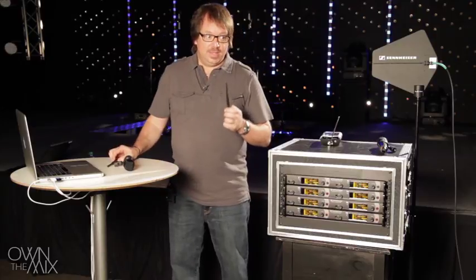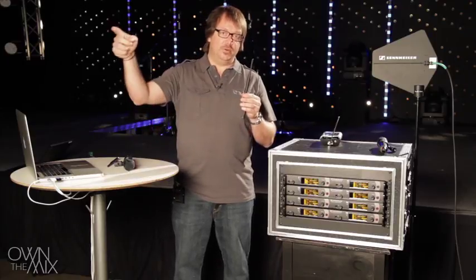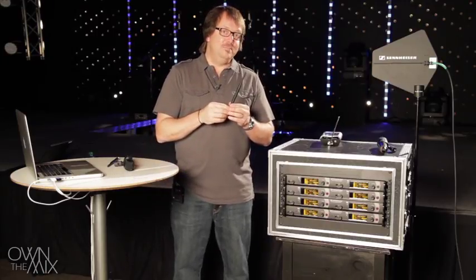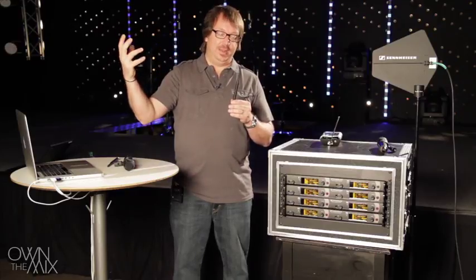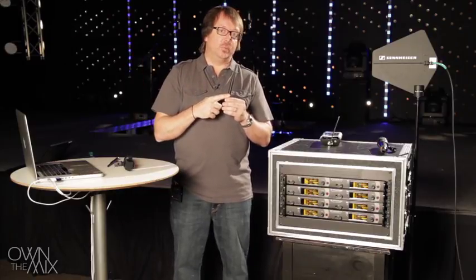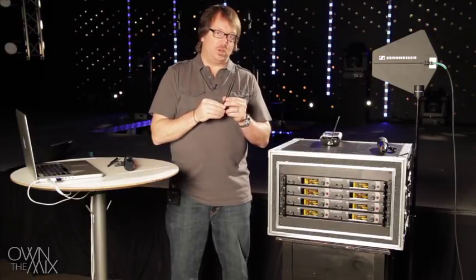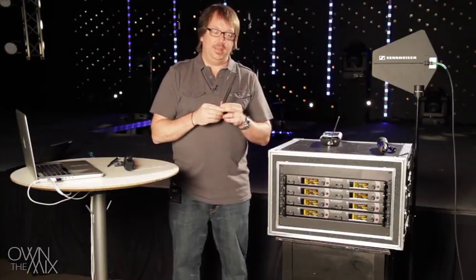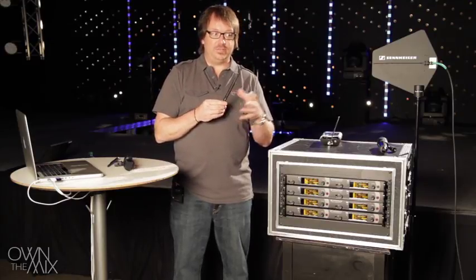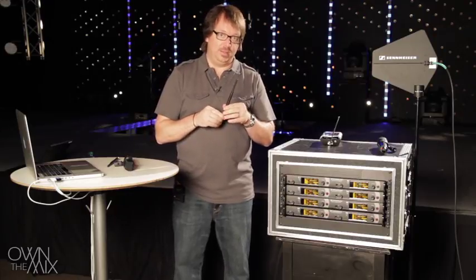If you imagine we put one antenna in space to receive in your church, the transmitter is moving about the stage — a person wearing a body pack or maybe holding a handheld wireless transmitter. As they move around, the RF leaves the transmitting antenna and reaches the receiving antenna multiple ways: directly, but also reflecting off different objects in the room. These multiple paths can cause phase cancellation due to multi-path, and the bottom line is a dropout. If phase cancellation lines up just right due to these reflections arriving at our receive antenna, the system can drop out.